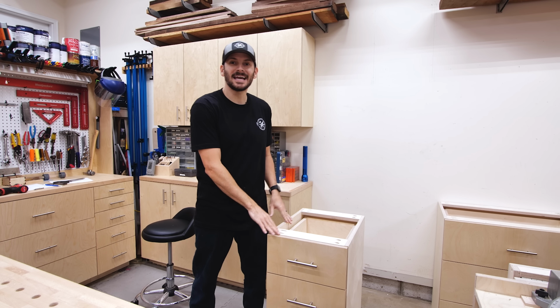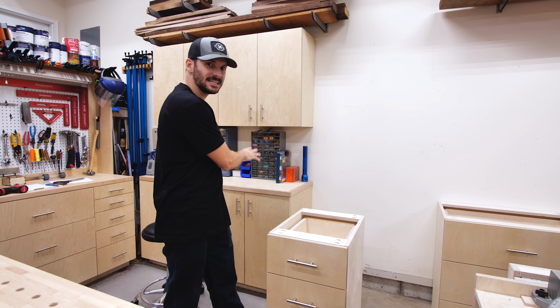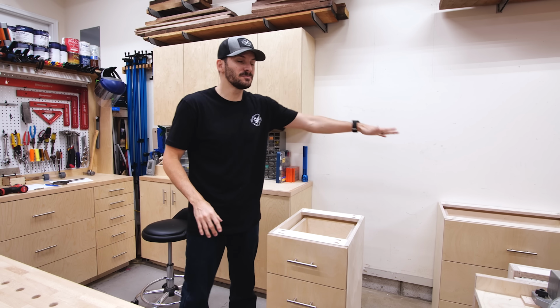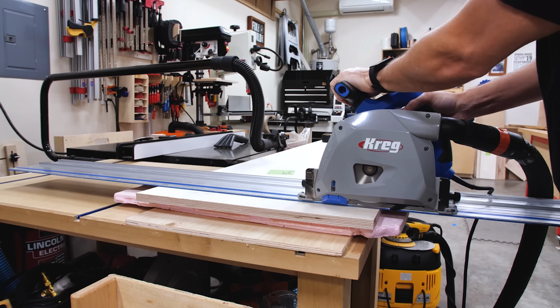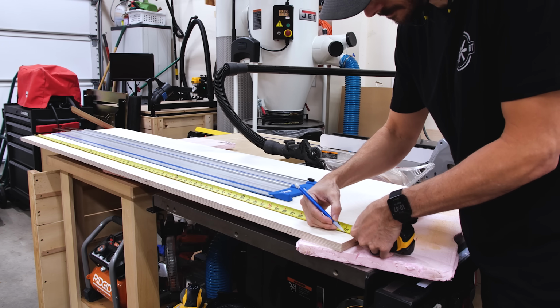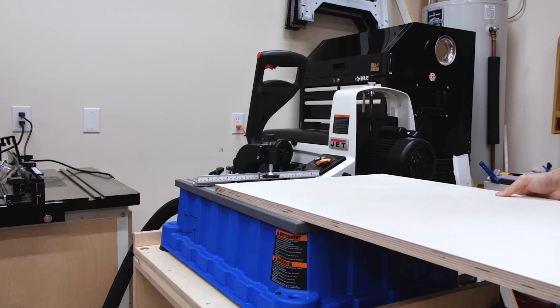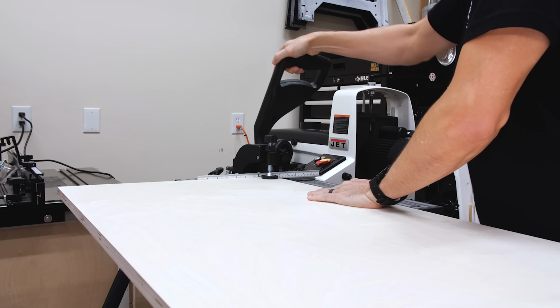All right, I got the little base cabinet done, and now I can move to getting the top made. So I need a 75-inch top for this left side, and then I'm gonna move that 60-inch top over there. So I'm gonna cut that down using some plywood, and then I'm gonna trim it with maple, and I'll use pocket screws to attach that from inside, so you won't see any fasteners.